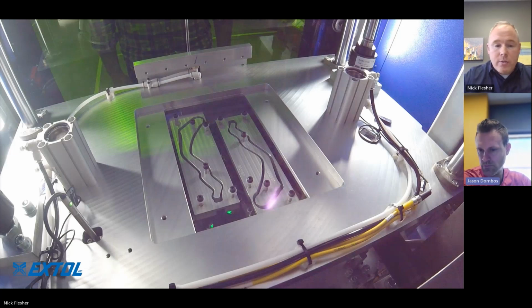Another great question is a fan used for cooling. No, we typically don't. It's not usually required. And really, we find that you only need 2 to 5 seconds for laser welding. So it's really quick. How much meltdown? Excellent question. It's really small. If you're familiar with vibration welding, you're moving multiple millimeters, and with laser welding, this particular application, I think was 0.6 millimeters. And that part's approximately 6-7 inches long. Yeah. So it's really precise.